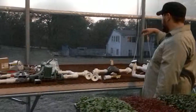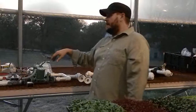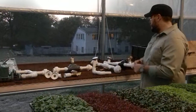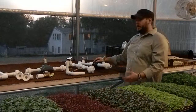So our hot water comes out of the hot water tank. It goes through the supply module, the air scoop module, the pumping module. Then it comes back, goes through all the benches. We're going to use the reverse return to get the water in the correct order back from the benches. Then when that cold water comes back in, we're going to put it through the return module and then into our heating source.